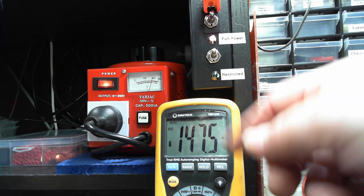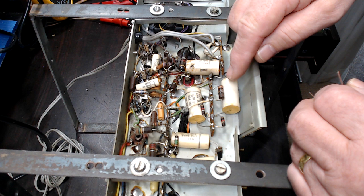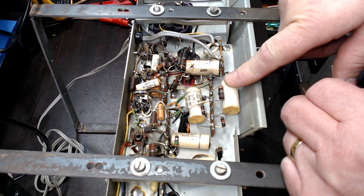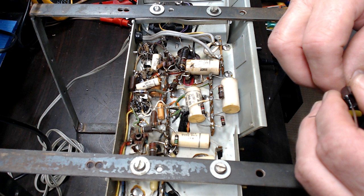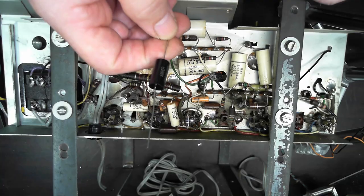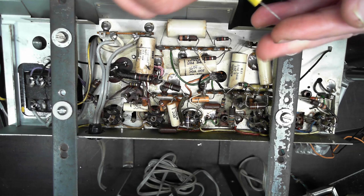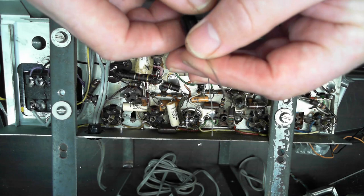I'm going to change some caps. These ones look almost plastic and wax-filled. I noticed the voltage on the B+ was coming up slowly while the radio was running, meaning the caps were reforming — that would be these electrolytics in here. The replacements are caps from Carl's Capacitor on eBay — they're black all over and look much better in a radio than sticking a yellow one in. For this one, though, since it's not a particularly old radio I'll use old stock ones I've got lying around. I'll leave a link to Carl's in the description.